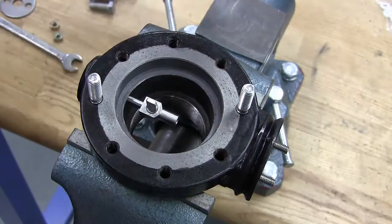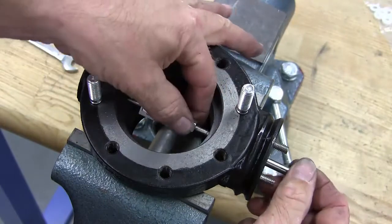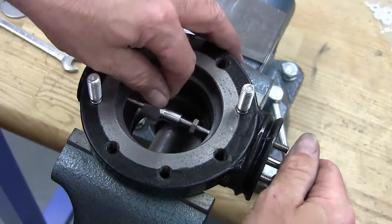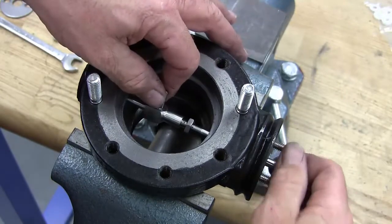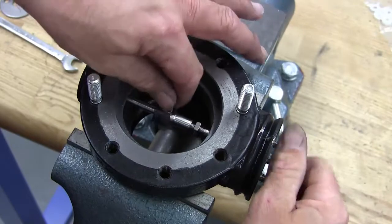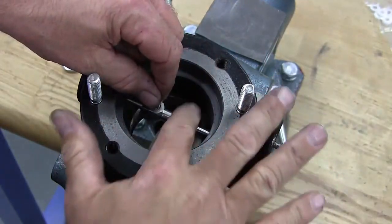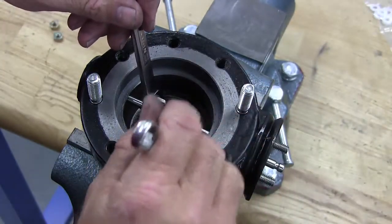Insert the disc pin into the body. Now insert the stem with the jam nut. Thread all the way until it doesn't go any further. Next, tighten the jam nut using your 2 wrenches.